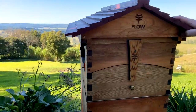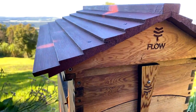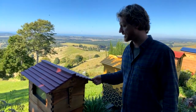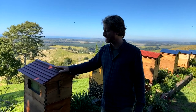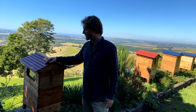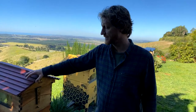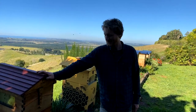People notice we tend to paint our roofs — the roof really cops the weather and falling debris. If you leave the roof without paint it'll gray or go mildewy the quickest. It's nice to really protect that roof, which also limits expansion and shrinking in changeable weather and creates a better seal. It's nice to get lots of paint in the joins to create a weather seal, or even a little bit of silicon as you put your roof together to make sure water's not coming through those shingled boards.